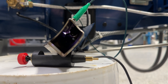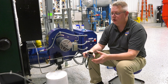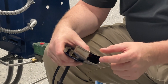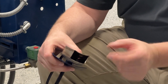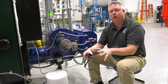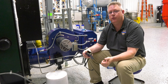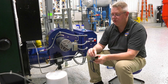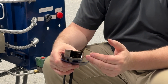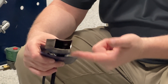We've got to look within the pilot assembly itself. The key to any pilot assembly is making sure that we've got that spark arranged the way that the manufacturer intended. We can see that the spark igniter is centered on the gas spud, and we can actually see carbon in there as a result of that being fuel-rich at the spark. That carbon tells me I don't have a great mixture at the spark, reducing the likelihood of successful light-off. We can also get carbon bridging between the electrode and the surface. Based on the manual diagram, this igniter should actually be rotated so that it's arcing off the bottom housing, not the fuel spud, and should be an eighth of an inch off the bottom metal plate.